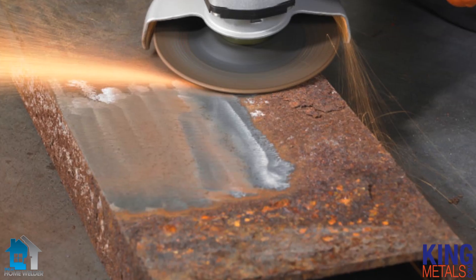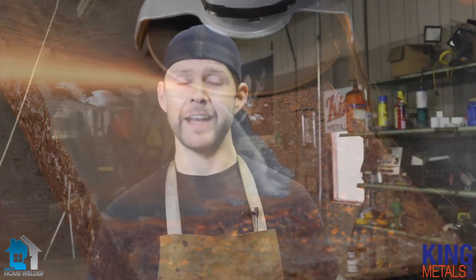So that being said, what grinding wheels should you use? Well, that kind of differs on your project. A lot of people just use those big hardcore thick grinding discs, and those work great. But in our business we do a lot of ornamental stuff — railings, gates, custom furniture, and light fixtures. We don't really want to be taking those big hardcore grinding discs to those welds. They will grind those welds off quickly and easily, that's great, but you also run the risk of digging into your material.